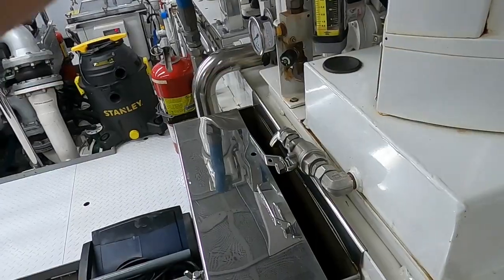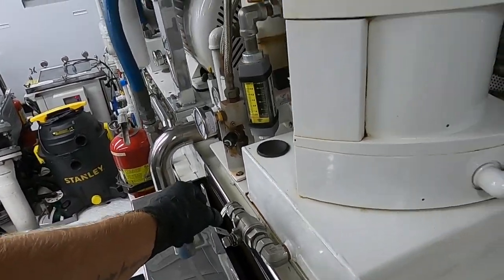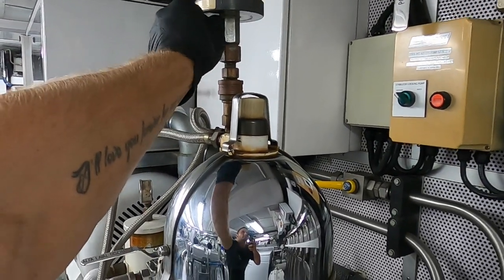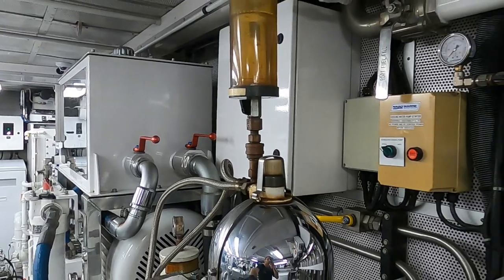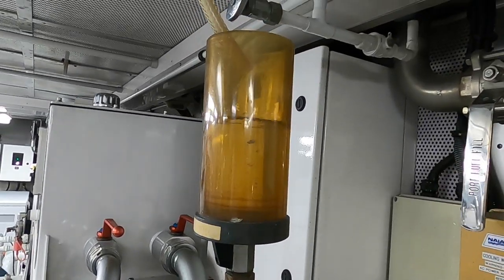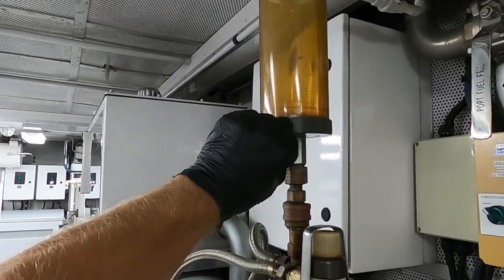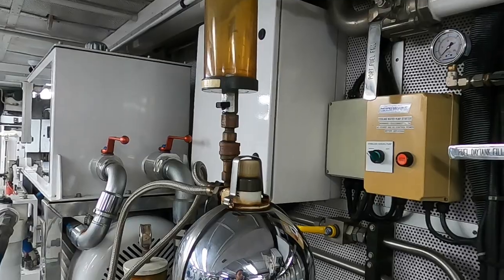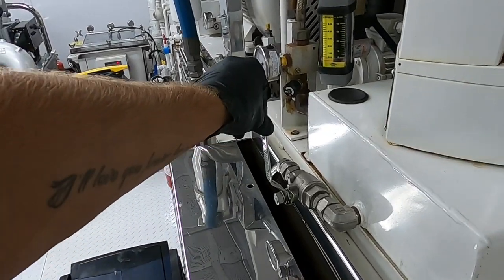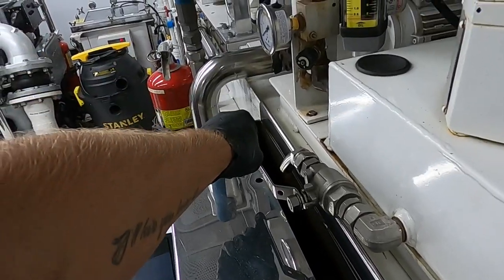I will turn off the sound so you can hear me. Before I let fuel get there, I must close the drain valve. Supply fresh water for plate rinsing. You can see the water disappear. When the water is gone, I am shutting off the valve. I let the Alfa Laval some time to work. I am opening the drain valve just to make sure that the water is in its place. Nothing drips.